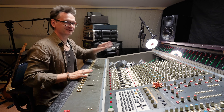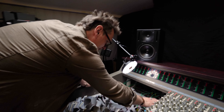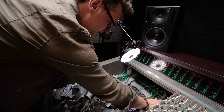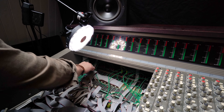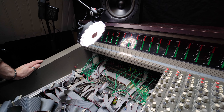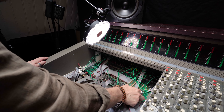I don't think it's meant to be changed very often. So now we're back at the console with a big hole where all the faders were. Here we have the circuit board with the battery that we are going to take away. We need to unplug these two cables, these two cables, and these ribbon cables — and there's a ribbon cable there as well. We took some pictures before so we remember the position of everything.